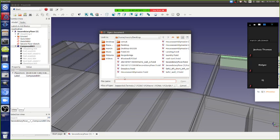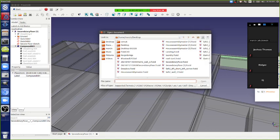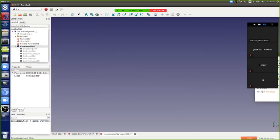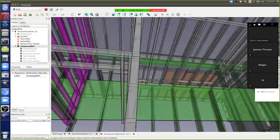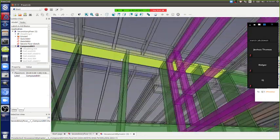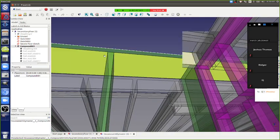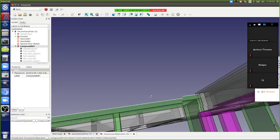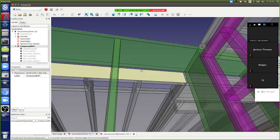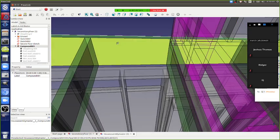Yeah, it's exactly right. And what is the spacing of the blocking we selected? It's 24 inches. That's for the joists? Off to the side. So we assume each joist is 1.5 inches because it's just the depth of a 2x6. And then you measure 24 inches on each, and then 7.75 inches away from that is where you put the edge of the blocking, to either direction. 7.5 inches. 0.75. Right.